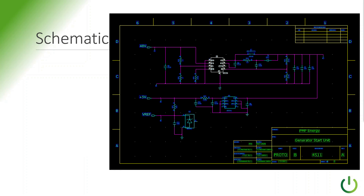This is one sheet of the schematic showing how we take the 48-volt input and go from that to provide 12 volts for all the FET drivers. The 12 volts then has an additional step down to 5 volts for the logic circuit. The 5 volts goes to another integrated circuit that provides a voltage reference, which we can use as a precision reference to monitor what's going on with the battery. That's the schematic.